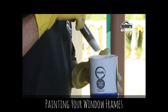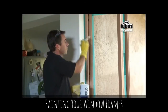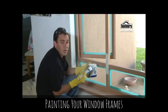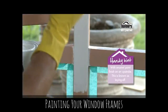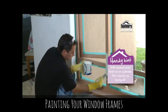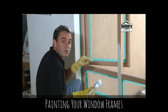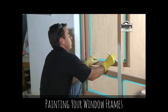When painting, make sure you use the right size brush — this is a 38 millimeter brush. It's going to allow us to get right in close to the edges and on these thin surfaces. With enamel paint, it's always a good idea to finish on an upstroke — it just allows the paint to settle back down again and blend in neatly. When it comes to the windows, always apply the paint nearest to the window and then pull away. The last thing you want to do is slip and put a big splatter on the glass, so always pull away.